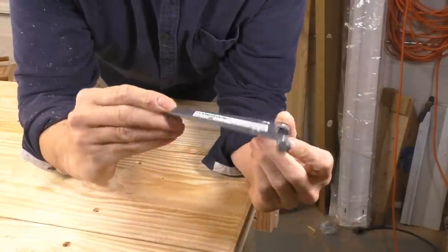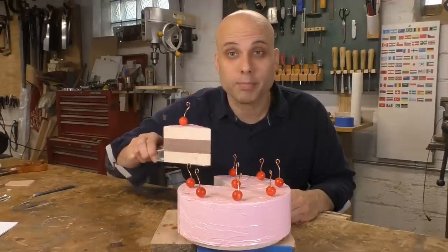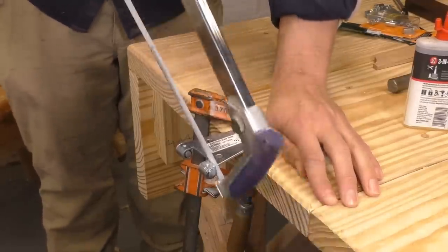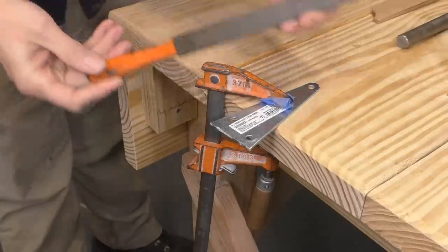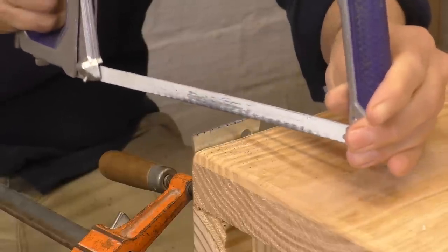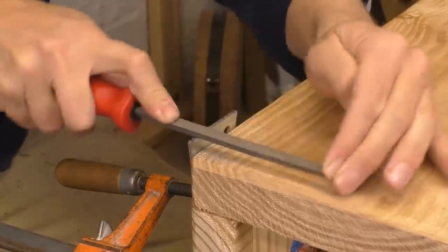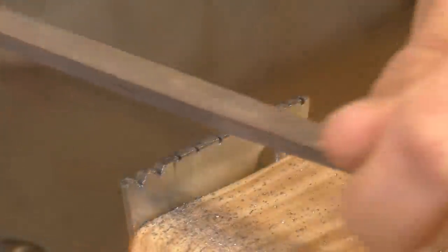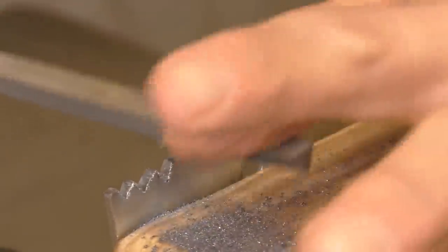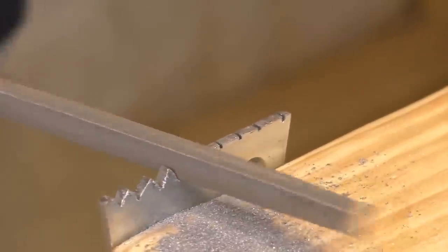This is me, so I'm also going to show you how to build your own with about 10 bucks worth of spare parts from the big box store. We'll start with half of a six-inch strap hinge — I used the other half to make a toy cake server for my daughter. With the hinge clamped to my benchtop I can hacksaw off the parts I don't need and get a square edge. For cleaning up I like this Nicholson handy file — it's got a built-in handle and two different sets of teeth. Then with the piece clamped upright to the apron, I'm hacksawing a little notch every quarter inch. Those notches give me a starting place for filing the teeth. These Tecton triangular files aren't super high quality but they are cheap and they come with a comfortable plastic handle. It only takes about 20 minutes.